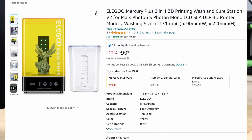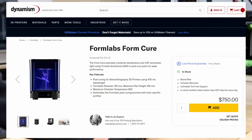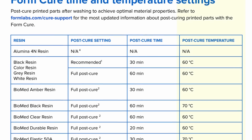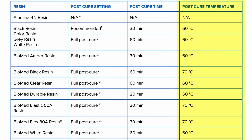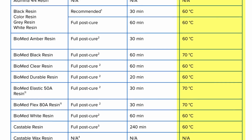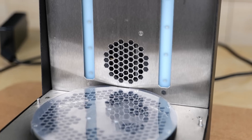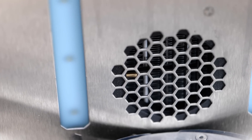Most inexpensive curing stations only have a UV light and a turntable and nothing to actively heat the parts. On the other side of the spectrum, you have Formlabs' curing station, which is designed to go all the way up to 80 degrees Celsius, and if we look at their material datasheets, none of their resins is cured at less than 60 degrees Celsius. So there must be something to curing at elevated temperatures. My Prusa CW1S washing and curing station also has an integrated heater that can increase the temperatures in the chamber up to 60 degrees Celsius.